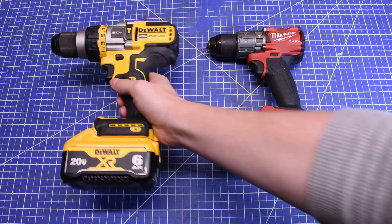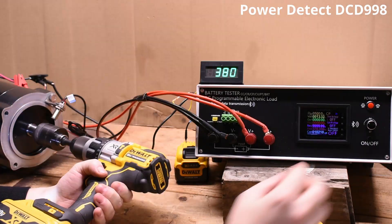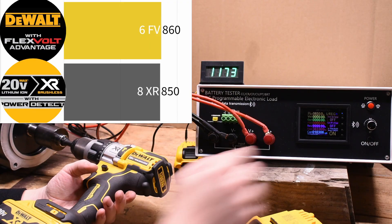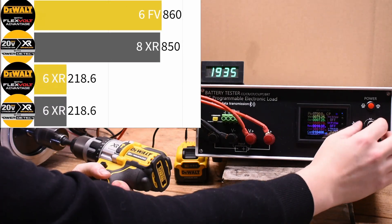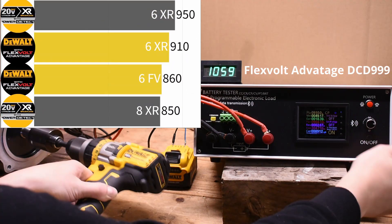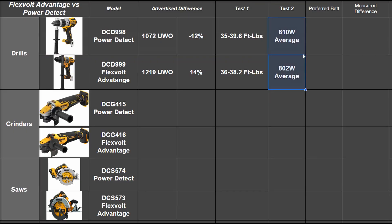But that's torque. They rate these tools in watts — something more difficult to fool; it's straight up motor output. We'll focus on tools in their high settings. With the included battery, the POWER DETECT makes 850 watts. The FLEXVOLT ADVANTAGE does a little better with its included battery at 860 watts — about the same. Using the battery neither should do best with, both seem to prefer the 6Ah XR with Samsung 30T cells inside: 910 and 950 watts for the POWER DETECT. So if you had to pick one, the POWER DETECT is more powerful — and not 12% less. Across all batteries tested, it's close to 2% more, and the FLEXVOLT ADVANTAGE is about 1% down rather than 14% up.